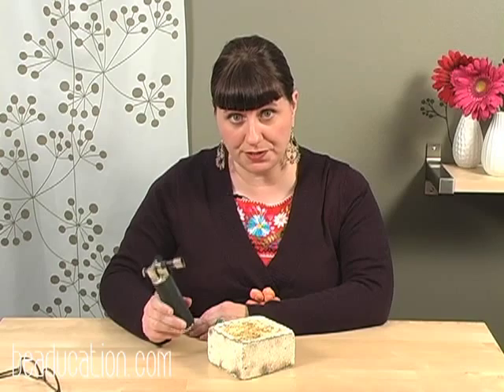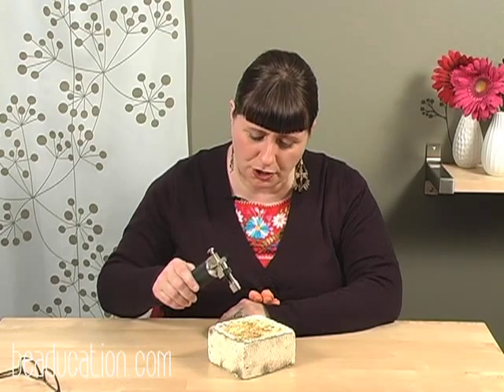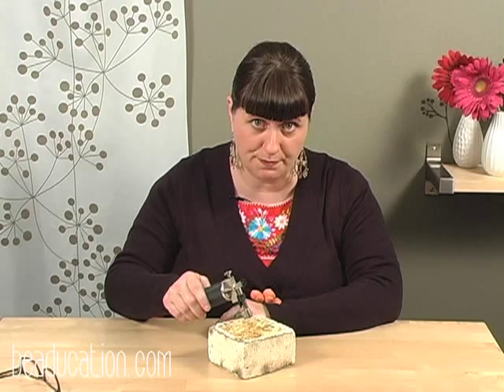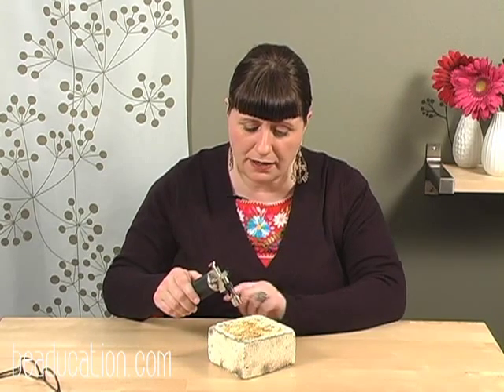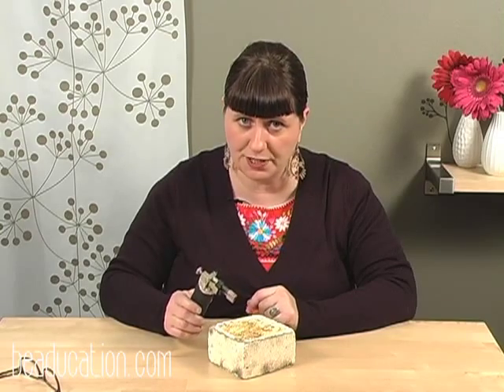You may wonder how close to get the torch to the piece. When you turn on the torch, you'll see a dark blue cone come out of the front. That dark blue cone sits slightly above the piece — the tip of the cone doesn't really touch the metal but hovers just over the top. The kiln brick grabs and retains heat from the torch, making it much more effective. One caution: this butane torch has limitations on size — on larger blanks anything over about an inch and a quarter, it just can't keep everything hot enough to solder effectively.